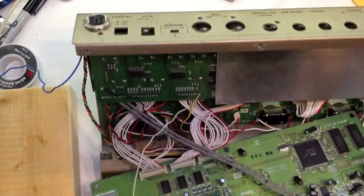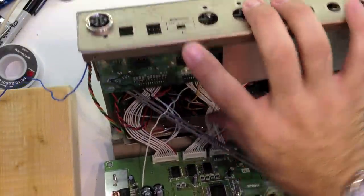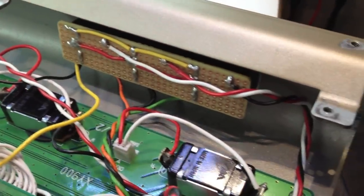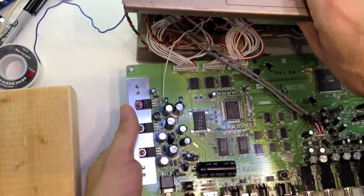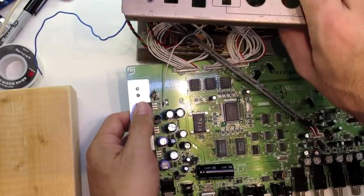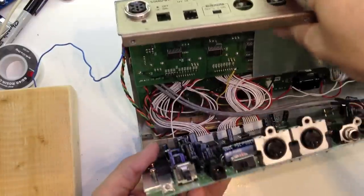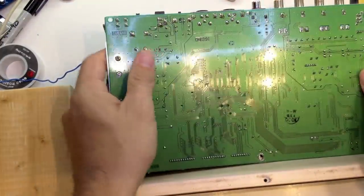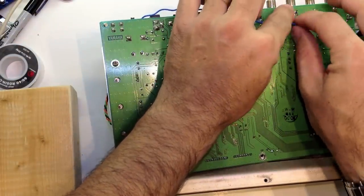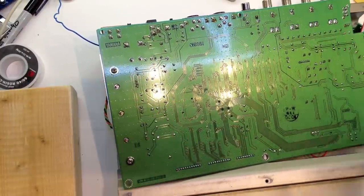Moving right along, there's just a board of relays in here. That's all it is. I use relays for isolation, so I wouldn't have to tap into any of the circuitry in the stomp. There's just a board down there with three relays. I'll get a better shot of it in a minute. Those relays just click on and off for the buttons. And then if I slide this way, you can see there's power. There's a 7805 right here, and two 7815s here. I took power from the 7805, with minimal current draw from the sub pedal, which has all the brains in it. That's pretty much it: power and ground. And then there's one other wire that I unsoldered, this guy here that goes over to the phones output, and that provides the signal indication. When there's an audio signal in there, the decimal point lights up according to how much signal is in there. So that's pretty much it in a nutshell.